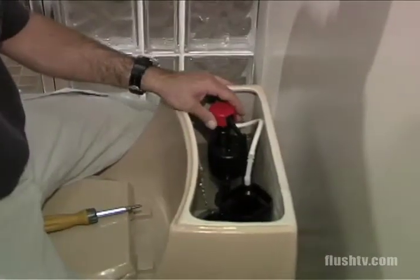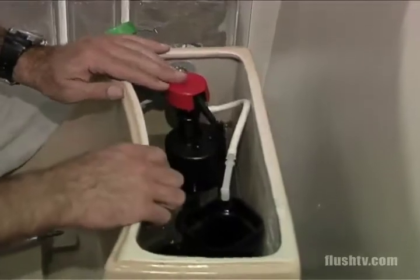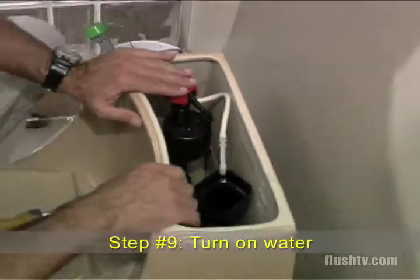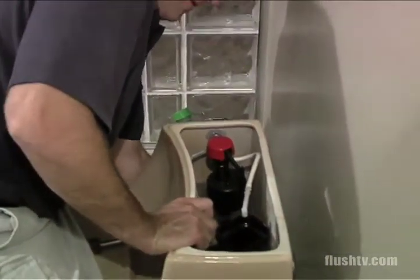We're going to connect our new supply line to the bottom of the fluid level control valve that we put in. I'm checking the nut to make sure there's no leakage — it seems fine. We're connecting the bottom nut by hand first, then connecting the three-eighths connection to the emergency shutoff valve on the other end of the supply line. Right now our new fluid level control valve is set in place, the flapper is set, and the chain link is adjusted. Now we can turn the water on — we have our new supply line installed, so we'll reach down to the emergency water shutoff and turn the water on.